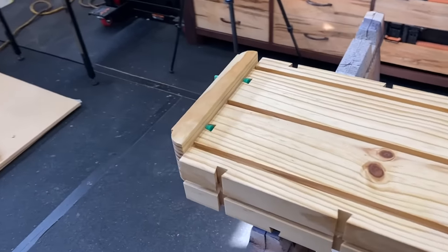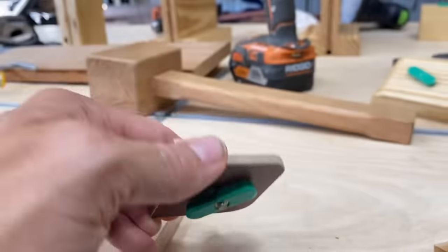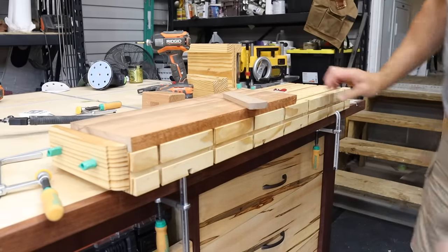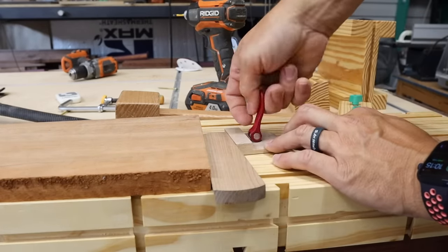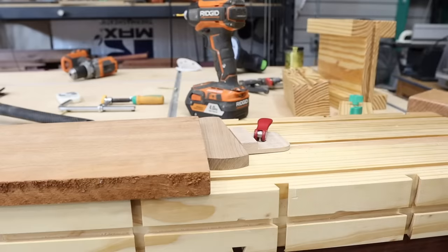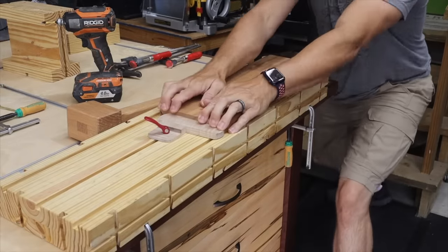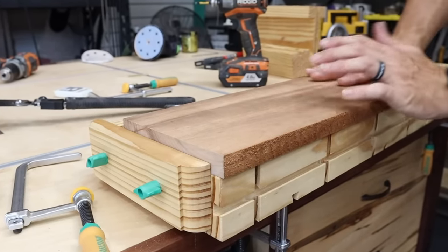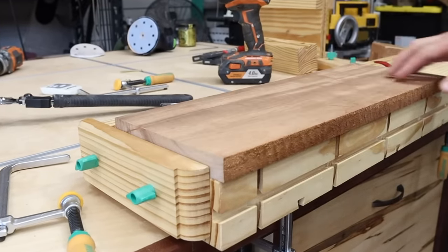This was designed so that you could actually work on three quarter inch stock without having to worry about any of the clamping getting in the way. This is a plane stop — we've got our cam with this special cam lock. The cam just runs in that dovetail track. You have this wedge that has a five-degree angle on it, and the cam has a five-degree angle on it, which locks everything in place. So you just run that up there, tighten your cam down, then take your mallet and drive your wedge in there. What that does is wedge it against your plane stop — now this piece is held in place. You can sand it, you can plane it, you can work on it however you need to, and none of the work holding is getting in the way of the actual surface of the board.